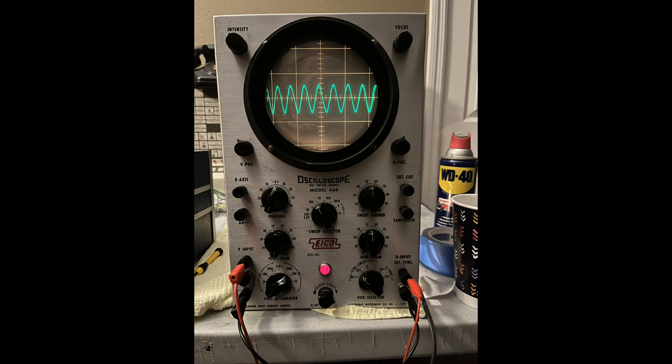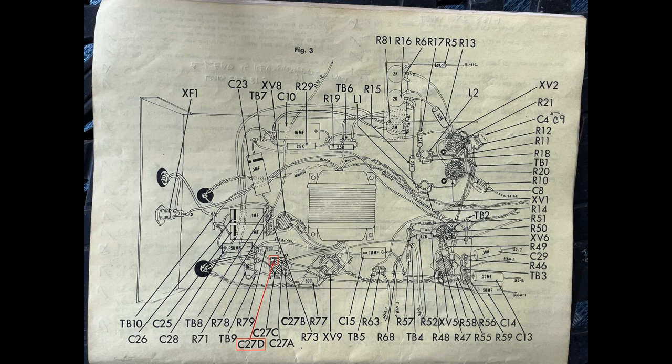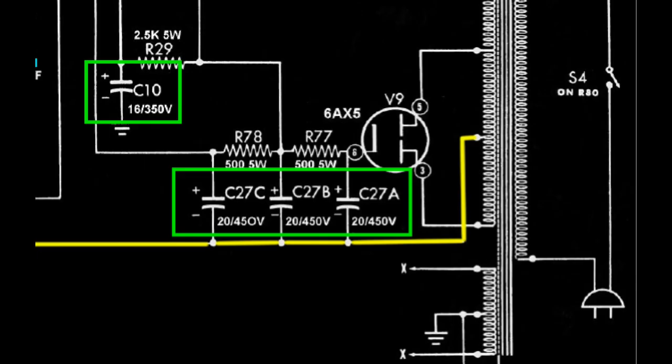So what lesson do we glean from this? Use drawings for their intended purpose. Pictorial diagrams are fine. They're great as a supplement to the schematic if you want to buzz out a circuit quickly. But you shouldn't base any decisions about functionality on them because it might lead you to overlook something important.